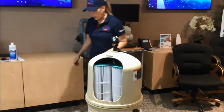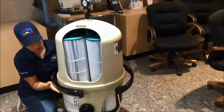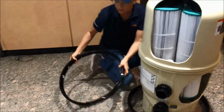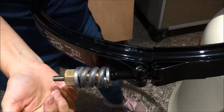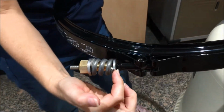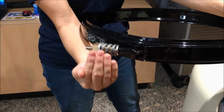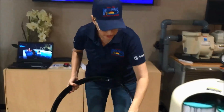Okay, so now you're ready to put your bracket on. This helps to have two people, but if you are doing it with one, it is possible. Getting this to go through the other side, sliding it on, and then I'll show you here on the one that's pretty simple. Making sure that you do it in the right pattern by following what you took a picture of on your cell phone earlier. You'll have the nut, the washer, the spring, and again the washer. Okay, so when you have this around it and you tighten it, make sure that the fingers of that spring are fully closed. That's when you know it's done. If you see them touching each other, it's good. It's got the right pressure and it's holding that all in place.